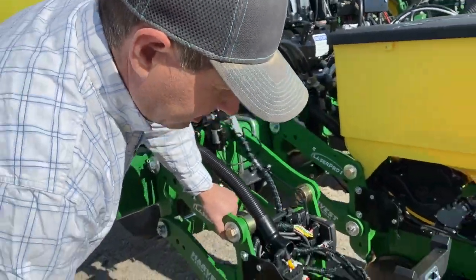To explain the center nozzle fertilizer system — what we're doing infurrow: we're using a speed tube to deliver the seed to the ground. The sensor that's reading the seed is built into the speed tube. We're taking that signal and communicating to a component called a DASH from 360 Yield Center. It gets the signal from the speed tube saying the seed's coming down, and in nanoseconds, we actually inject fertilizer right at the seed at a distance we specify. For example, if we want a two-and-a-half-inch long dash, right as the seed comes down, it will place a two-and-a-half-inch dash at the seed, then stop, close, and open for the next seed — instead of streaming fertilizer all the way down the whole furrow.